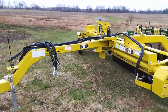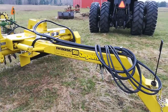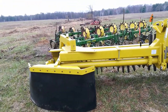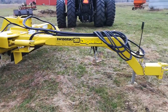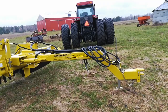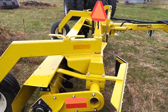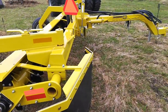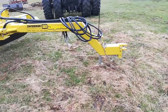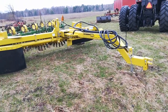This is the new rock rake. I tried to buy a used one at auction but they're like three-quarters of the price of new, and these things aren't cheap. I got it up here and this is in the field position — I've been playing around with it the last couple days. I'm hoping between this and the rock picker I got to use at auction, I can really cut down on the about 40 acres of rocks I have to pick almost every year. This goes along in a 15-foot wide swath and leaves a windrow of two to 18-inch rocks. After disking, they should be on the surface and this will leave them in a windrow.